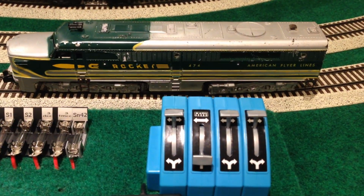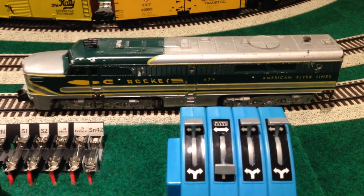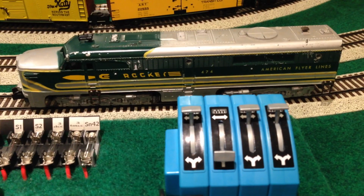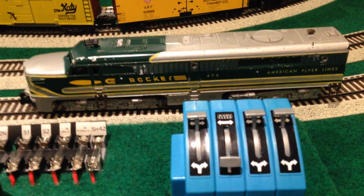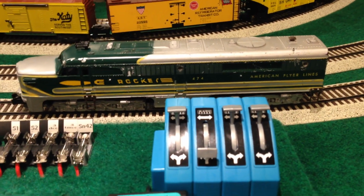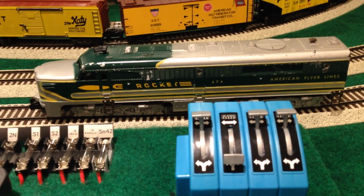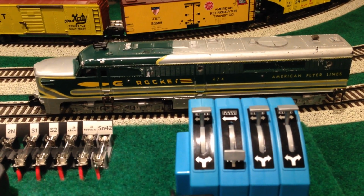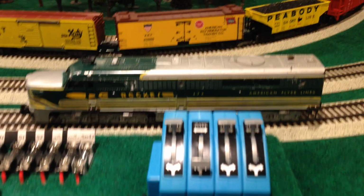Now the 474 was almost the opposite of the Comet in that in this case the motors did not need to be disassembled. The brushes were solid and well intact, not surprisingly worn much at all, and the armature bearings didn't demonstrate any play. The drive gears were centered, but it did need both motors degreased, which I'm able to do without having to completely disassemble the motor, and fresh lubrication applied in the form of light and medium oils and a good multi-purpose lithium grease.